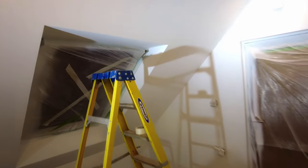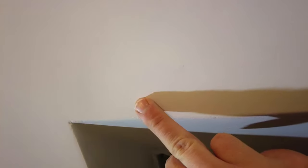The bits where too much paint went on where the filler was - it's not too bad, you can't really see it that much. I would maybe knock it back a little bit but I'm going to leave it and go with the next coat. I said I was maybe going to back roll a coat - this goes on super flat and if you knock it and you touch it in with a roller it's going to have a different texture. What the professionals do is spray a coat on and then when it's still wet go over it with the roller to give a slight texture. But these walls, you do one wall at a time on your own - it's a big wall and I haven't given myself enough time to do that.